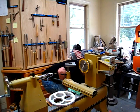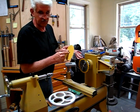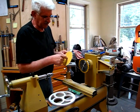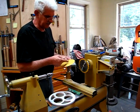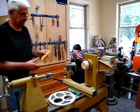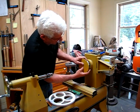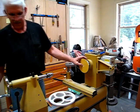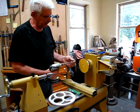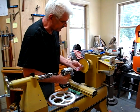You have to cut the hole out using a razor knife, a sharp razor knife. After you stick the first side of the paper on, you take a knife and cut that hole out. Then you stick the second side and then you cut that hole out. So then I put this on there, push it on — you want that to be a nice tight fit. And then all I used was a washer and a screw. I pre-drilled this in the drill press so that it'd be very centered, and then just tighten it up.